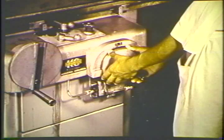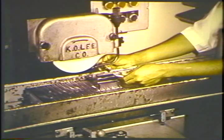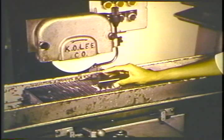After the wheel has been checked, and if necessary, dressed again, set the table feed so the grinder will take off no less than 1/10 of a thousandth or more than 3/10 of a thousandth each time it makes a pass. Make the finish passes required. Note, on many machines, the crossfeed will have to be operated by hand. Measure the workpiece while it is still on the chuck, and if it's within the specs you want, remove the work from the chuck and clean up the machine.